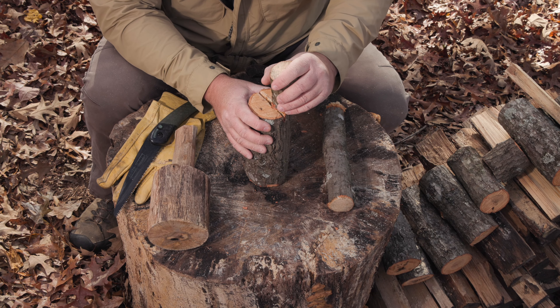From here, I'm going to start with the larger wedge. Begin to use a mallet, or you can use another block of wood — whatever you have on hand — and begin to strike the top. I'm going to alternate now in between these pieces of wood. And as you can see, I'm starting to get a crack now. It's forming down the side.